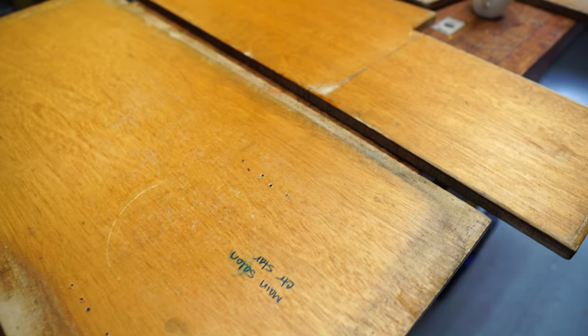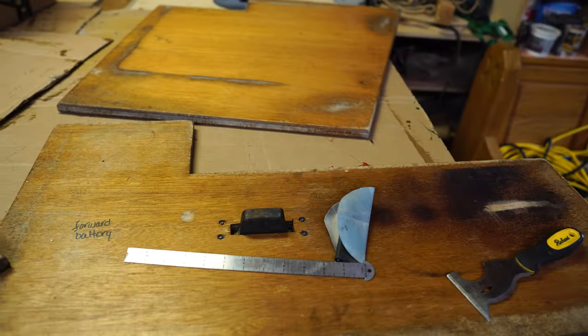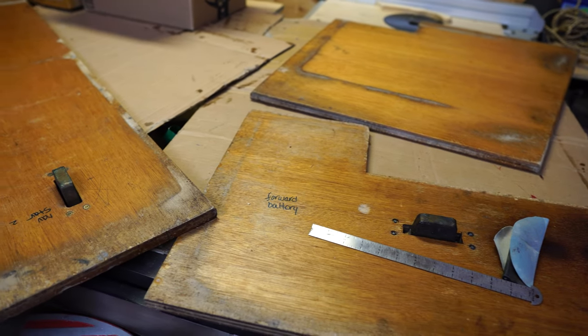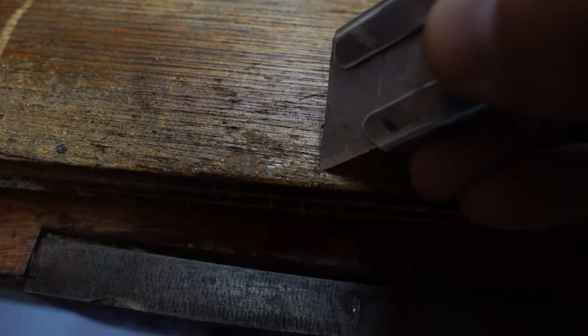We brought back six more pieces of our floor from inside our boat. Like the other ones they're in a little bit rough shape, but in general better than the first few pieces which were the worst. As you saw from the video when we were at the boat, they don't really match anymore, and taking a closer look at the existing ones the finish is pretty much gone — it used to be semi-gloss but it's down to almost bare wood. We're going to finish up these six more pieces so there are only a few more in the aft of the boat to deal with. I'm using little rasps to clean out the holes and indents from rocks pushed into the laminate or gouges and areas that have delaminated.